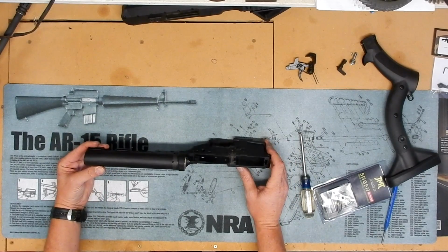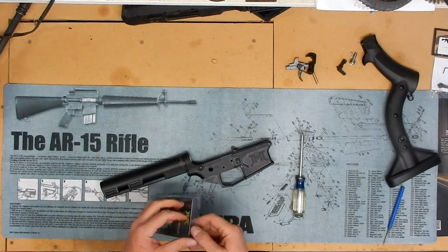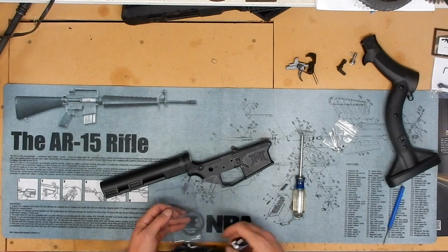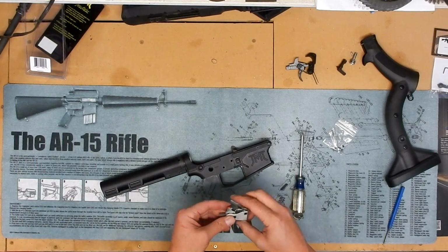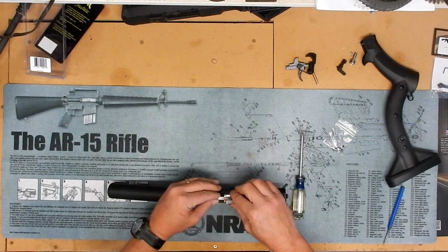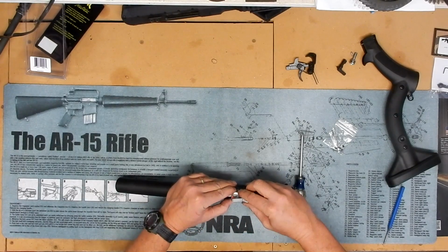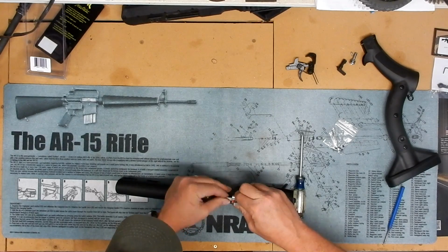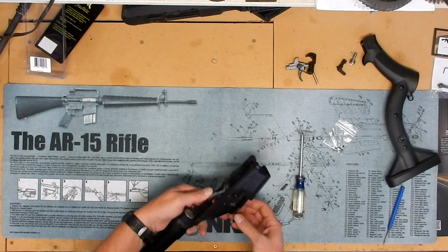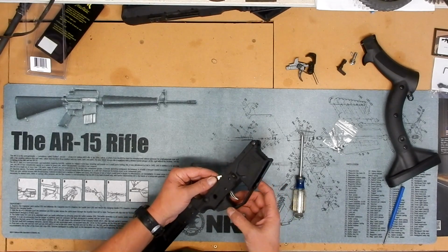The trigger housing area that I had to mill out when I was building this is now open. Let's grab the new Sabre trigger. I'm not going to need that. It should drop right in, if I milled the receiver right, that is. And it appears it's not dropping down far enough, but I can't see why.